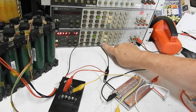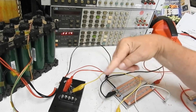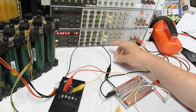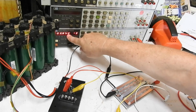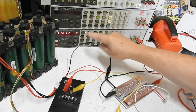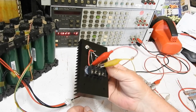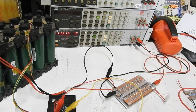But what we can do, we can say stick 0.3314, which is the current running through the circuit, store that into the Y register. So now when we implement the scaling function, it'll add 0, which doesn't matter, but divide by the current, 0.3314. So it will be directly displaying ohms on the display. So I'll put math, that function, and there we go. 11.6 times 10 to the minus 3, 11.6 milliohms. With just this and a power supply. And the math function, of course, but with other meters, if they don't have the math function, you have to do a little bit of arithmetic at the end.